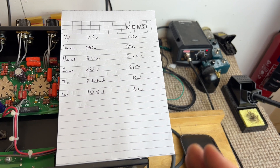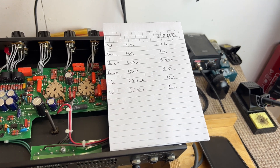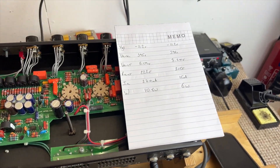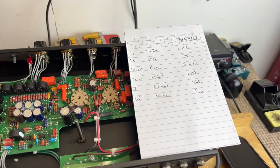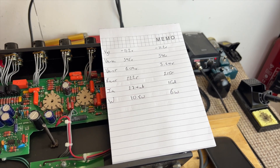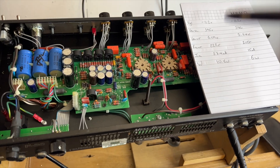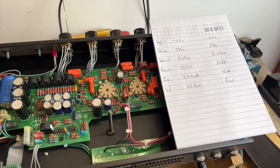I've just played the amplifier with a guitar, and it is quite loud — putting out a lot of volume — but for some reason on the test equipment I'm only getting five watts or so. I don't understand that, maybe I've confused myself with something. But either way, the concrete evidence I do have is that we've got a mismatched set of output valves. I'm going to recommend to the customer that we change those. His initial complaint that one channel wasn't working — it is — so let's see what he wants to do.